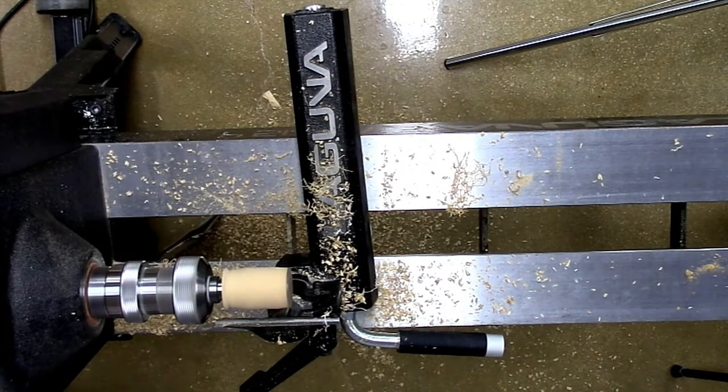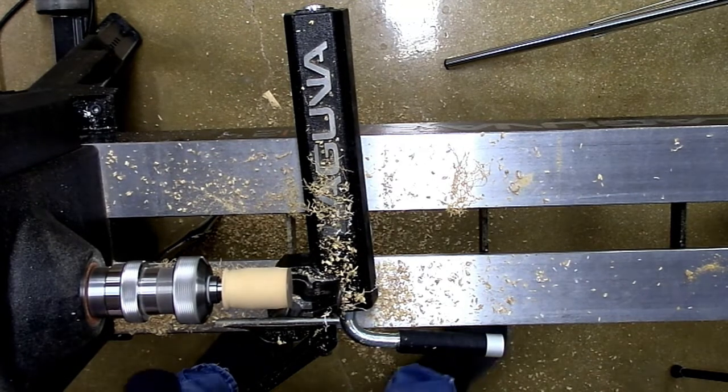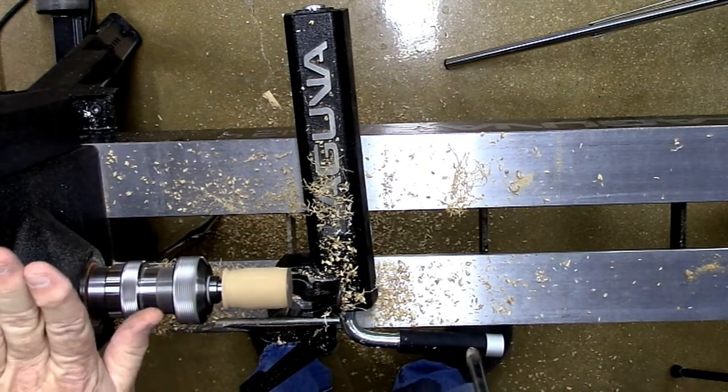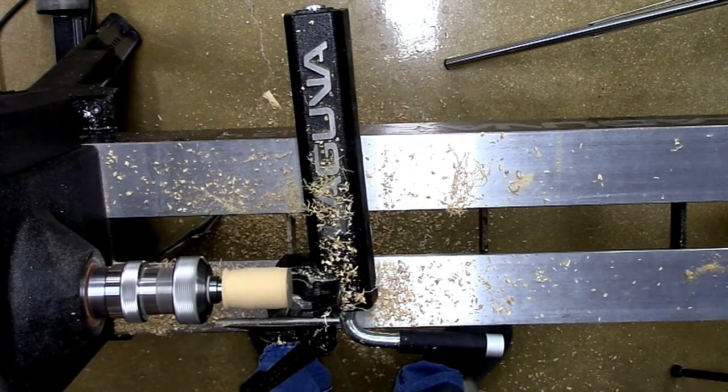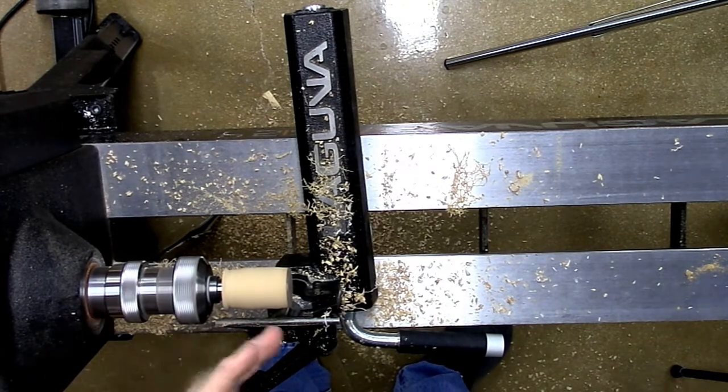But on most of them, and you can pass a couple of these around. Here's one that I did fairly well on turning it in on the acrylic, and then I'll send one around that I didn't do very well. That one I could have done better on turning it in. So I usually do it by eye. There's times when I've tried to go straight into what I think the width of the stopper bottom is, and that's sometimes a crapshoot. So I'd rather just get it close and then give it a little bit of a round over, and it seems to flow better in there.